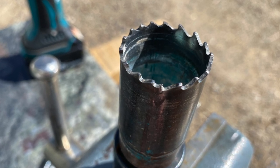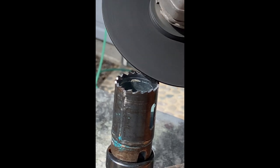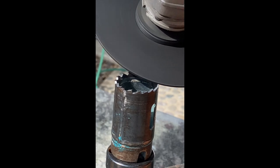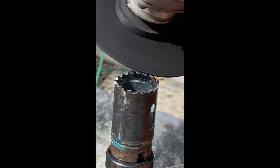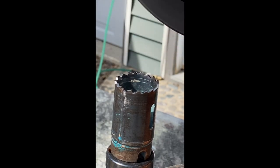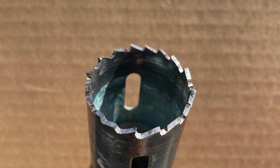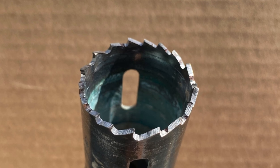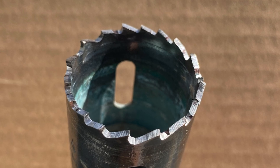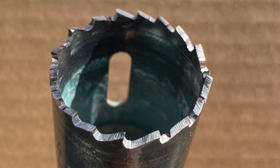Here's another bit — this one's pretty dull, let's give it a go. For this first cut I'm just trying to find the angle, and if I need to I'll adjust slightly, then grind it again one or two more times. You'll notice I'm going across the wheel so I don't stay in one spot too long. If you burn the corner of that tooth, that's it — it's done. You'll know if it's burned because you'll see a blue coloring, which means it overheated and lost its temper. There is a chance to go around again and grind it slightly to remove that. Here you can see the striations in those teeth — a little bit rough from the 40 grit, but it'll work.